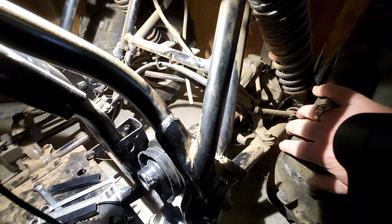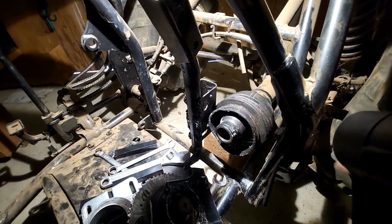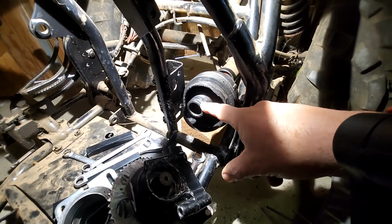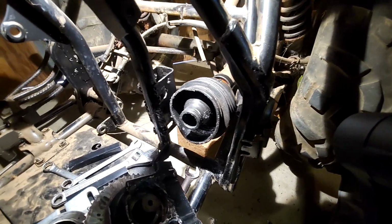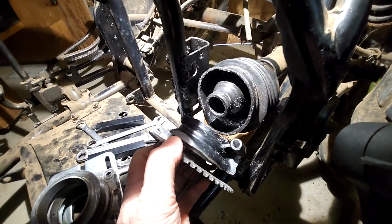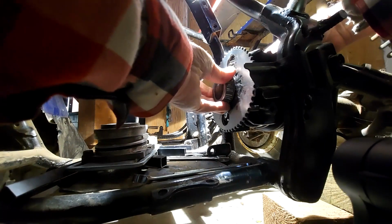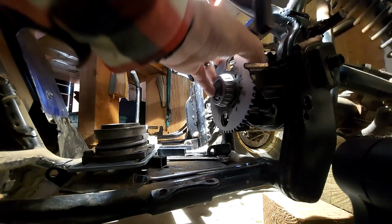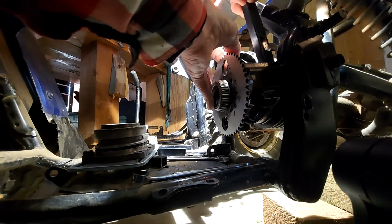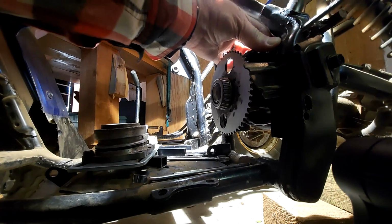So this is the drivetrain. Got the tires here, of course, the differential, the drive shaft, and the connection point. So as this guy gets turned, the tires get turned. And I need to marry up my sprocket with the drive shaft. I can bring the sprocket assembly in here. I have a spacer that I'm using. Insert. And then some bolts that go through the frame.